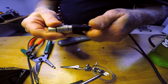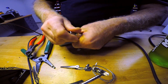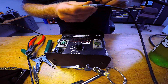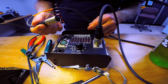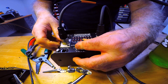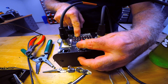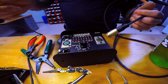Slide the outer sleeve up — it should go pretty easily. If you have to really crank it down with a lot of force, it's probably cross-threaded. Tighten it down pretty good, then grab a cable tester. You definitely should test it because stuff happens. Put them in — should be three pins. Pin one is good, pin two is good, pin three is good, and that's it. Good luck!